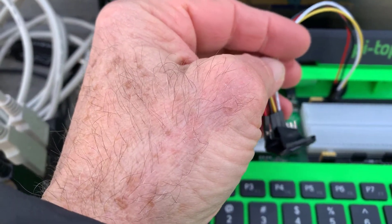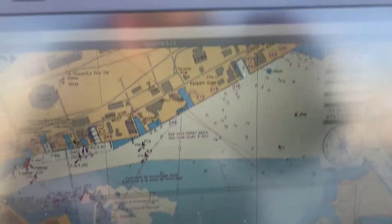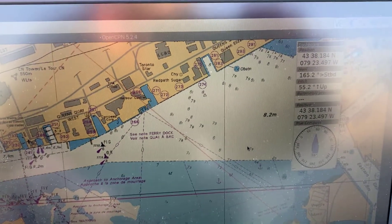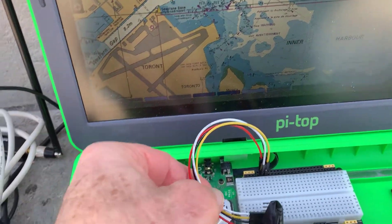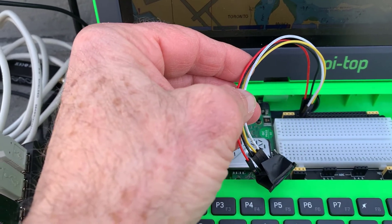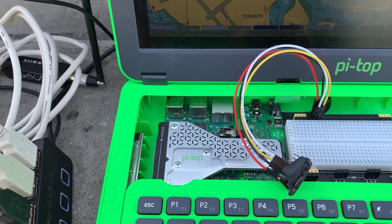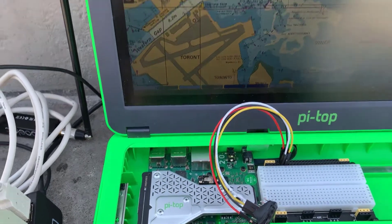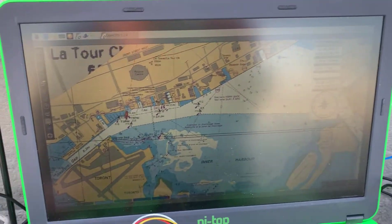This is the GY91 board, which contains an accelerometer, a gyroscope, and a magnetometer, a pressure indicator and a temperature sensor. You can see the various menus there — I can rotate the compass, it moves, and the pitch up and down on the roll, so that's working quite well. The temperature on this sensor works. Unfortunately, the pressure for some reason is locked at its lowest value of 300 millibars, and I'm not too sure if the sensor's gone. I tried it with Arduino and it was pegged at the lowest value as well, so it may not be working. Anyway, that's the setup — I've got the AIS, the GPS and all the sensors working.